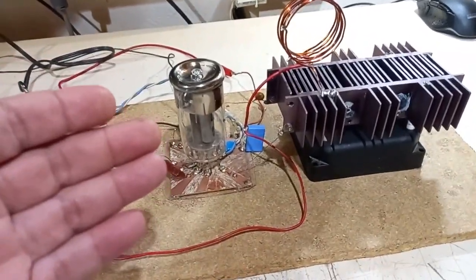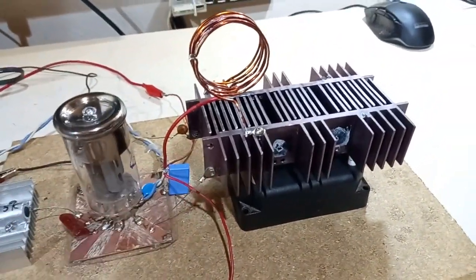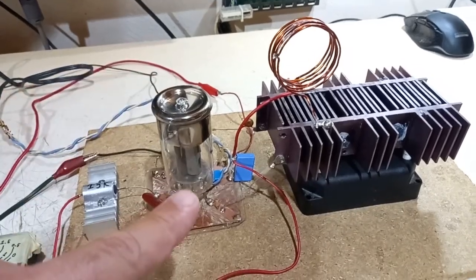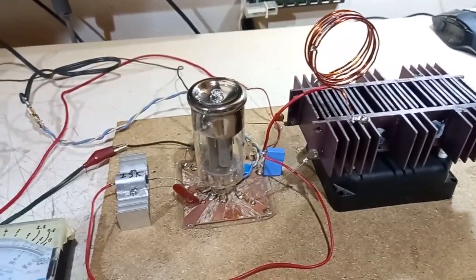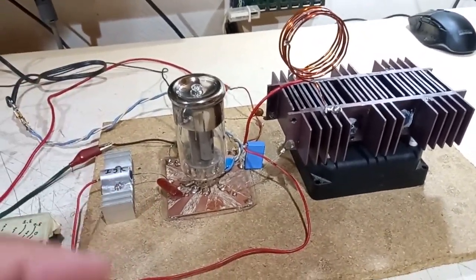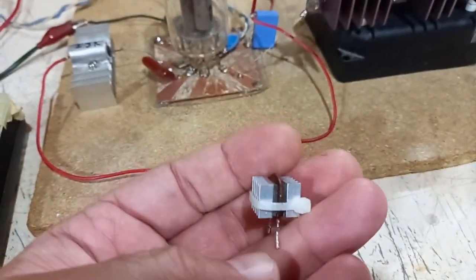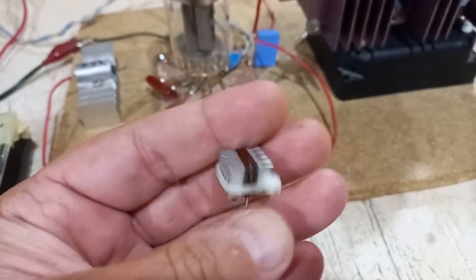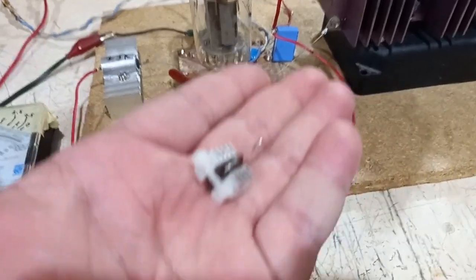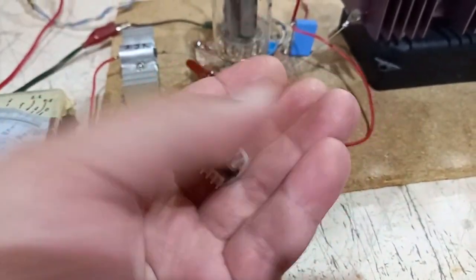I made several of these vacuum tube oscillators, single-ended with an external tank capacitor, not using just the stray capacitances of the tube, but not powerful like this one. I made a similar one with a PL504 tube, but it couldn't go much past 400 volts of supply voltage because the external tank capacitor — a high performance ceramic, high voltage capacitor — heated up a lot. I tried to heatsink it, but the heat was too much.